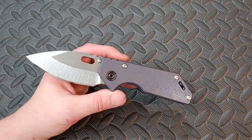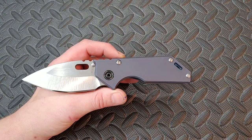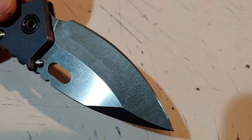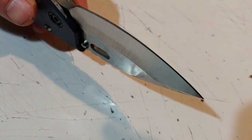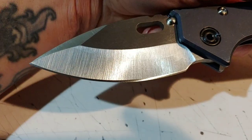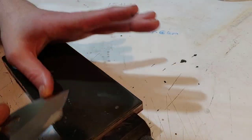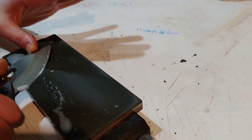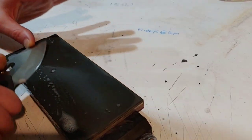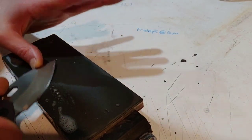I did cut with it a little bit, not too much, and I didn't record any cutting with it before I sharpened it because this isn't for sharpening. I wanted to feel what it was like to cut with it before I reprofiled it. You can see here the difference between where I reprofiled one side and the way it was before. You can see that the edge bevel is bigger on the side that I reprofiled. I started sharpening it after reprofiling. I knew I wanted to bring it up to a mirror polish, but I wasn't sure how it was going to go. So I just kind of went through my stones — after reprofiling, went to the next grit and the whole way up it felt really good. I had pretty good confidence that I was going to be able to bring it all the way up to a mirror finish.